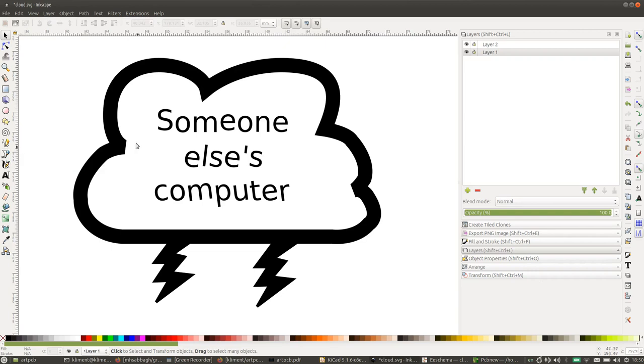Right, and I want this picture, this black stuff that's here, to show up in gold on the PCB. So I'm going to put this on the mask layer so that the copper underneath shows up. I need to put copper underneath and put this picture on the mask layer. Another thing I want is for this board to actually have the shape of this cloud.